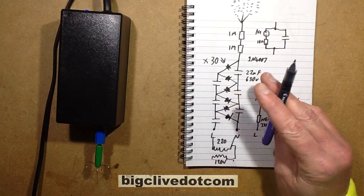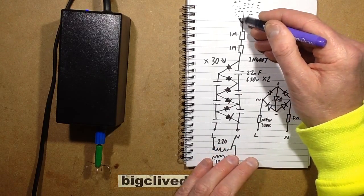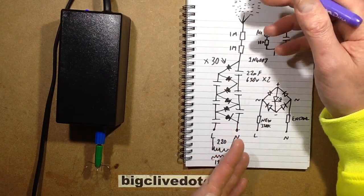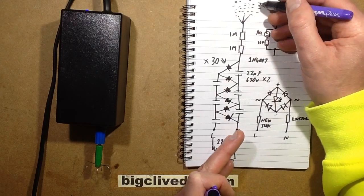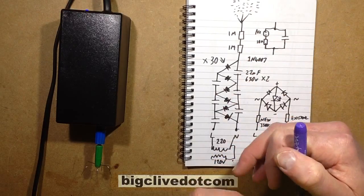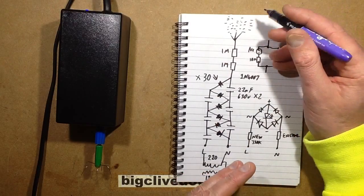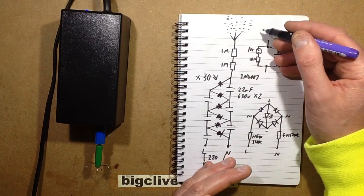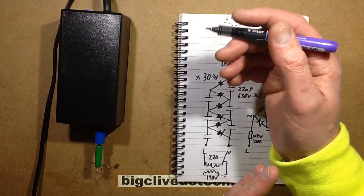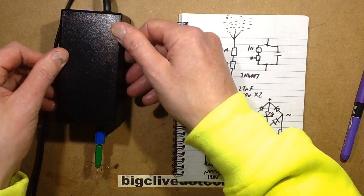They're very odd things. Because they create a high charge and they've got very sharp points, and the area of charge is most concentrated at sharp points, it basically charges the molecules of air. It basically creates an electrostatic charge in the air, and then because the needles are negative and the air is now negative, it repels away and it creates a sort of ionic breeze from the end of it, and that carries a negative charge into the air with respect to ground. It means that if any dust or contaminants in the air get negatively charged, then they automatically get attracted like a magnet to a grounded surface, and that's how these things work. That's why they always end up completely filthy, really dirty.